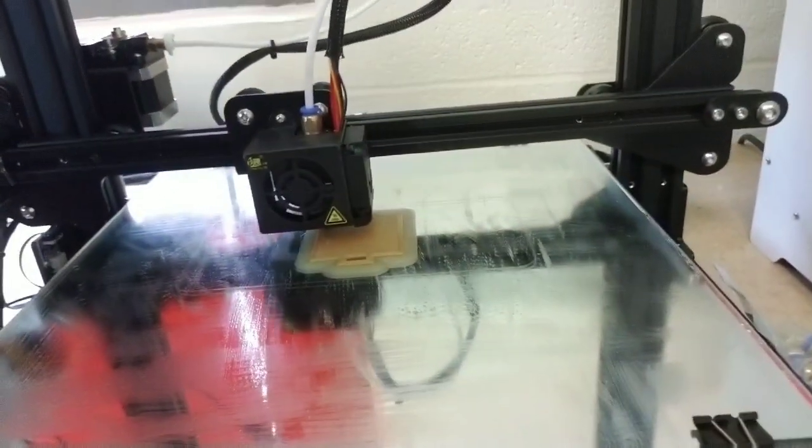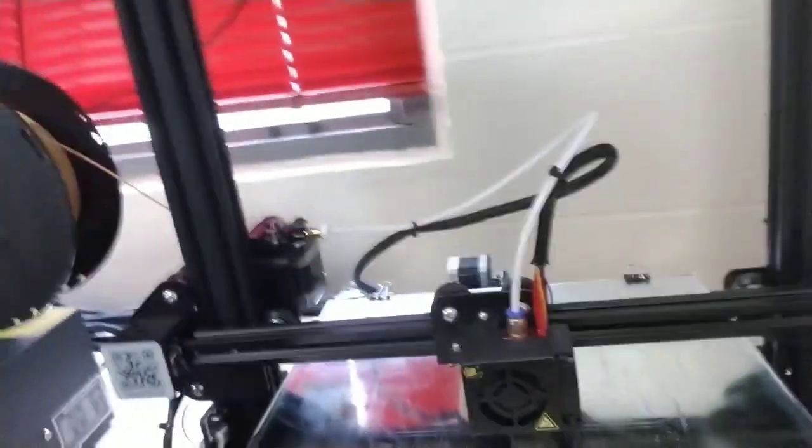This is what I call a functional print, meaning I design something in Fusion 360 for a purpose as opposed to art. This one is designed for the Pinewood Derby racetrack. We have an aluminum track for the Cub Scouts and the Boy Scouts, and we noticed that the little wedges at the end of the finish line, where the cars hit and slow down, have started to break off because the track's old. We could get new ones, but I thought, I've got a 3D printer, so why not make something I can stick into the end and give it a little flap, so if the car goes to the end, it'll hit that flap. That's what I'm 3D printing now out of PETG.